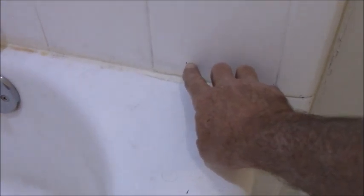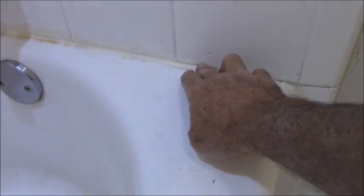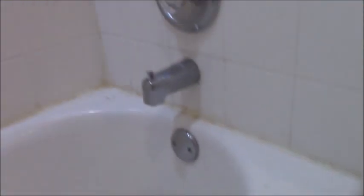So instead of having a gap here — a void — they're literally allowing water, once it gets up under the tile, up under there to the wallboard, the wallboard soaks it up and it can't dry out. And every time you take a shower or a bath and that gets wet, you're just perpetuating that cycle of water getting in there, and it can't get out as fast as it gets in. That's the reason why you have mold and mildew around tubs.